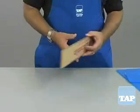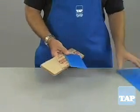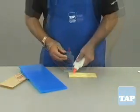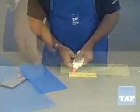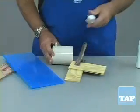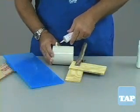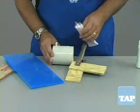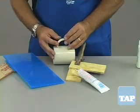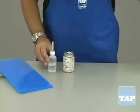To begin with, gluing acrylic is very different from household gluing most people have done. With household gluing, a viscous adhesive is applied between two surfaces. Because it is viscous, it fills any gaps. As it dries or cures, it bonds to the surfaces, which are then held together by the strength of the remaining dried glue. Gluing acrylic is very different.